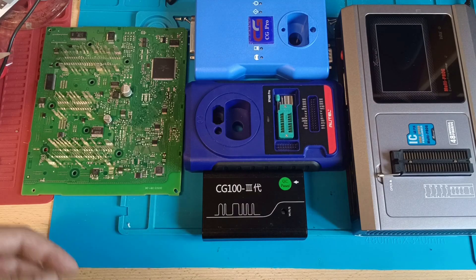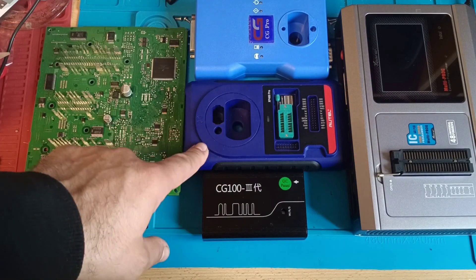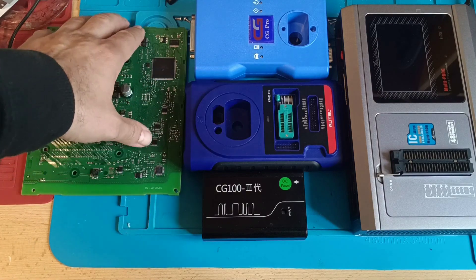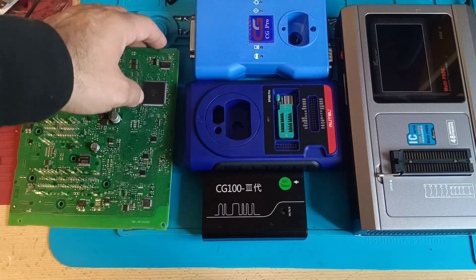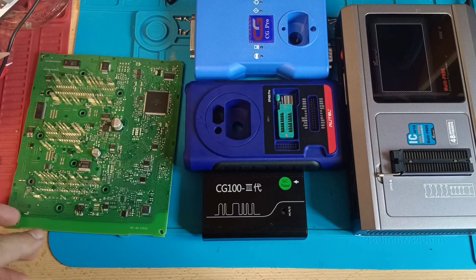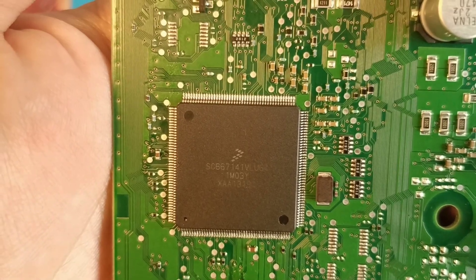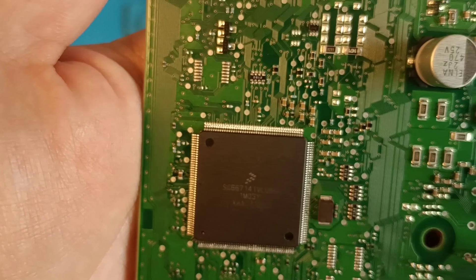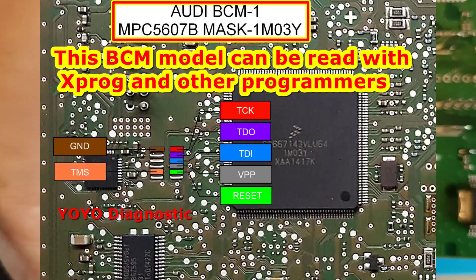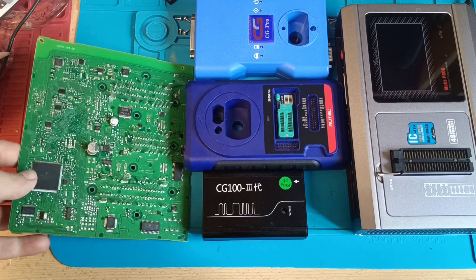This multi-prog doesn't help either. You have the connections, it's very nice, you have the diagrams — everything — like in all of these programmers. But no chance. These have different connections on the controller. When you look at this MCU, how the connection is with Autel, it's totally different compared with CG company and multi-prog. I was not able to extract the data. Please don't leave a comment below telling me you read this one with some clone — this is not the same board. You are not able to read it.